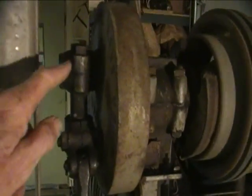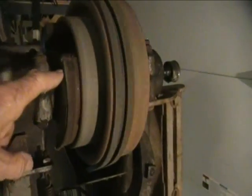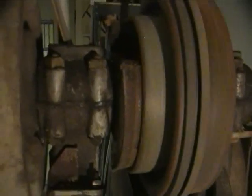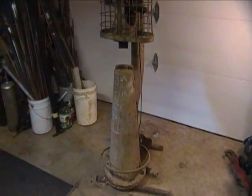So that's kind of an analysis of this particular trip hammer. There could be some wear right here — people file down this cap if there is. It didn't seem to be much of a noise; I don't think it even needs rebabbiting of the clutch. There's not much wear in there, especially once you grease it up on a regular basis. The gandy belting looks pretty good to me. This one doesn't have grease zerks; it has oil holes all over the place. Fred Kaler used to say he liked oil better than grease because if oil flowed out of something, if you let it sit, the oil could flow back in — whereas when grease gets squeezed out, it's gone forever. So that's it: Little Giant, old style, 25-pound hammer, serial number 284, built in 1910.